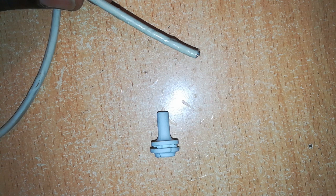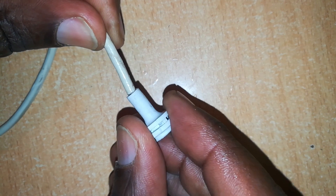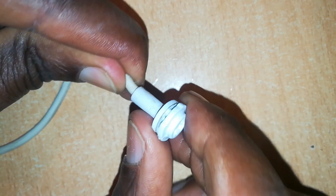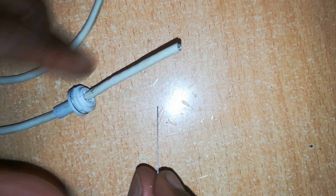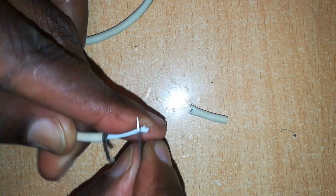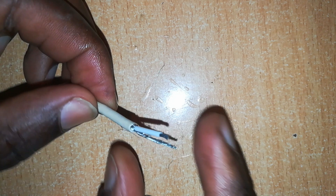We'll look for a new junction with this cable inside it and then solder. Here's a junction — another junction I've got to replace that. Now slide it over this cable. Once it's slid over, we can cut off the insulation and prepare the point at which we're going to solder. Now if you have heat shrink tubing, you could put it on top of this bare wire and shrink it down to make your work neat. If you don't, don't worry — we'll work with what we have.